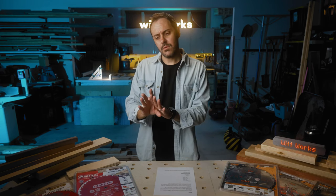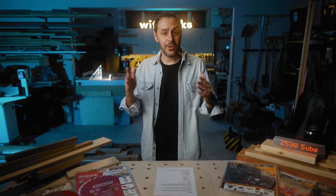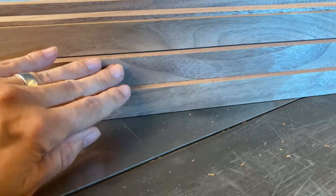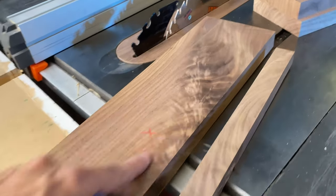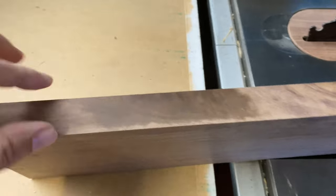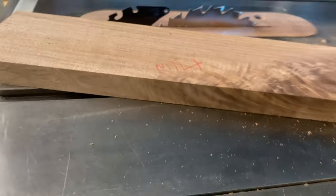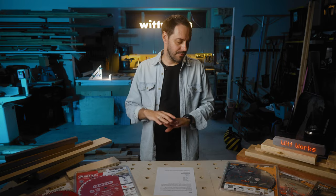The thing I don't know is how long that cut quality would last. I've used these blades for about five months, but I'm not sure how quality would degrade over time. The general purpose blade for CMT was really impressive — with a crosscut blade ripping walnut, I normally get burning, but with the general purpose blade I was surprised to get no burning. On one piece with gnarly grain I did get burning, but swapping to the 24-tooth rip blade handled it effortlessly with no burning whatsoever. Sometimes you can get away with ripping walnut with a general purpose blade, but the 24-tooth really did awesome.